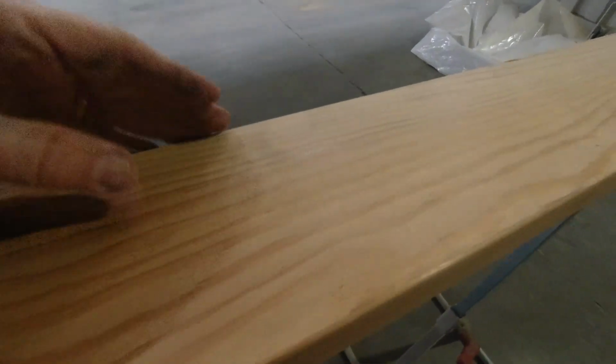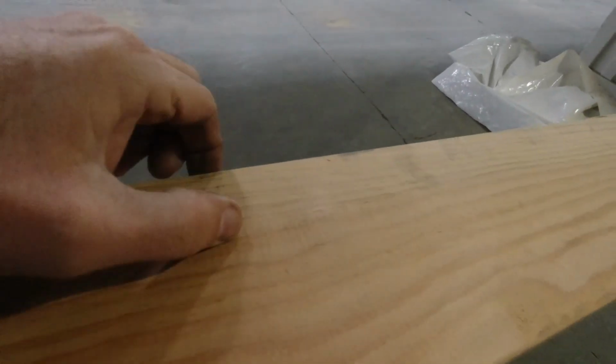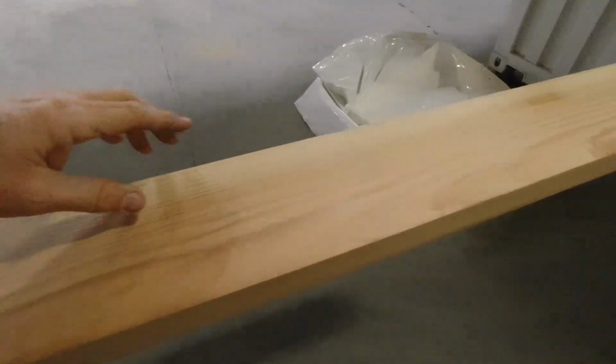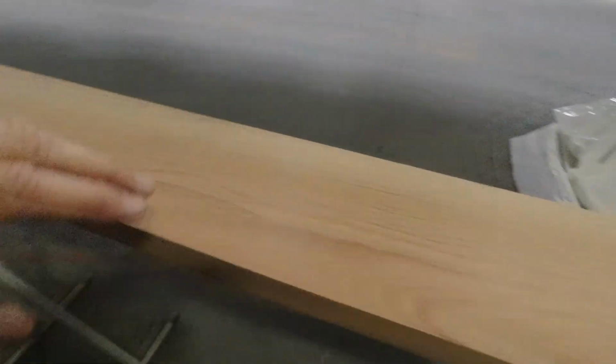So there are sections of it that are good over on this side, like right in the middle it's not so good, but when I say not so good, it's just they don't have enough grains per inch over there. But when you get down to this part of the board, there's plenty, and the other part of the board there's plenty. So I just analyze it as I go along and make sure that I'm achieving the required number of grains per inch. Fall off is not a problem on these boards at all. It just pretty much runs the entire length of the board. Occasionally when you get out toward the ends, it drops off a little bit, but it's still within spec. So yeah, okay, cool. Well, I'll get this cut.